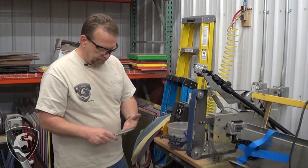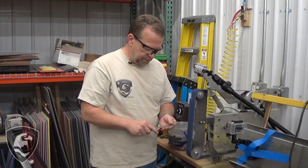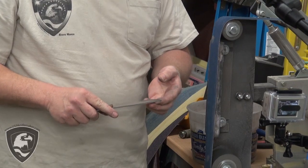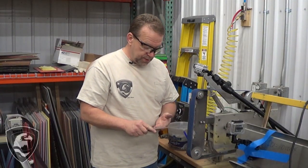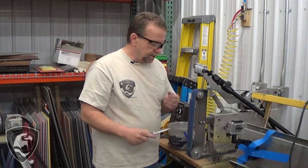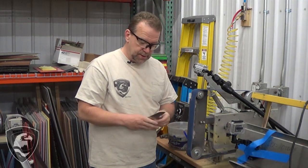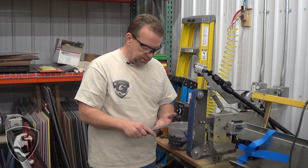We'll be dipping frequently. I'll be constantly feeling the edge to make sure we're not getting above boiling. If you're starting to see a color change in the edge of the blade, you've already gone past the temper and actually softened up the edge. So we want to see absolutely no color change. I always grab a fresh new belt, especially for this first step, to put that convex edge on there. Quick passes, keep the heat down. I'll be constantly checking.